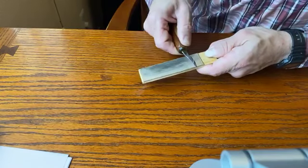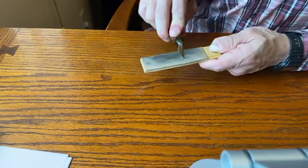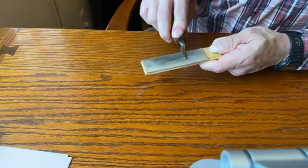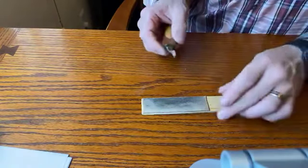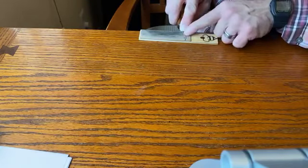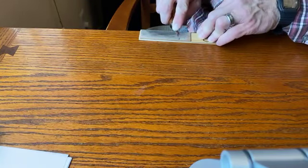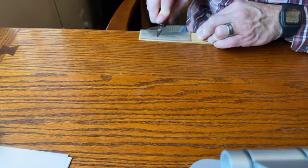2, 3, okay? Same thing on the other side, pull away from the sharp of the edge, okay? I didn't want to sound like a broken record, so I haven't said it every time I strop, but remember, you place the knife flat on the strop, tip it till the sharp of the edge just touches the strop, and pull away from the sharp of the edge. That's the only instruction you'll ever need for stropping any knife, ever.